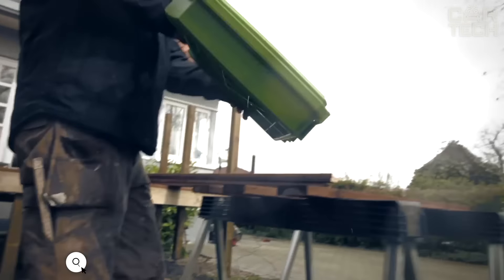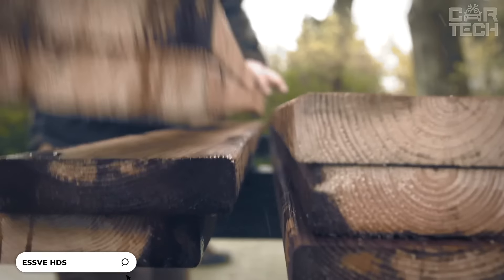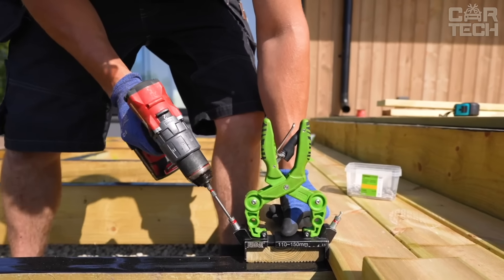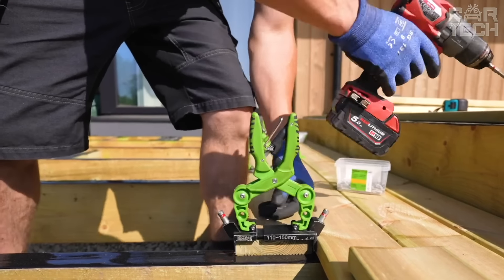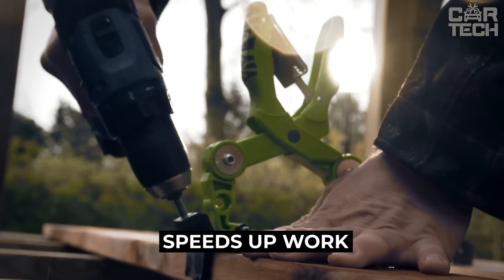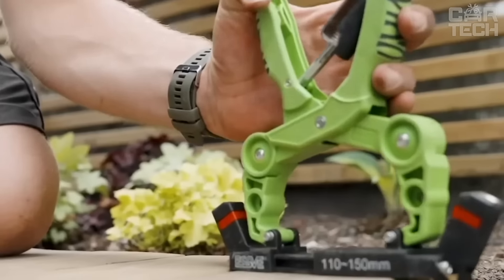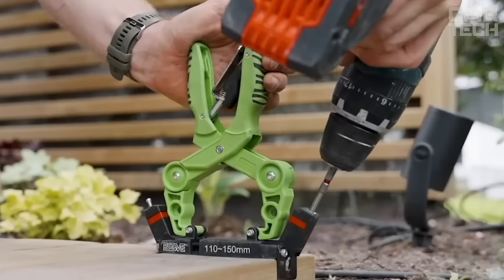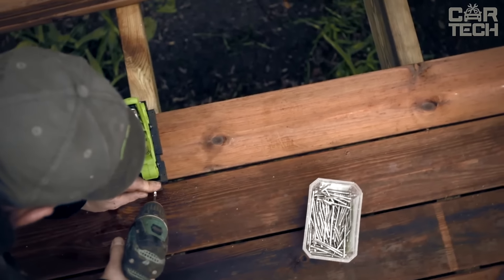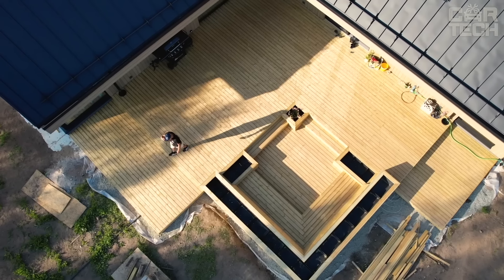The SV-HDS is an easy-to-use system that allows for concealed installation of the terrace. Thanks to the technology of fixing self-tapping screws into the side edge of the boards, the surface is smooth. This gives the terrace a luxurious and minimalistic look, which is difficult to achieve with traditional installation methods. The tool minimizes the risk of cracks or chips in the wood. Designed for use with stainless steel decking screws, included spacers provide space between each board. There are two versions of the tool — for installing planks 3.35 to 4.33 inches wide, and 4.33 to 5.91 inches wide.